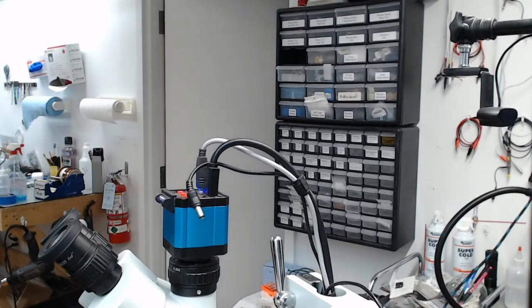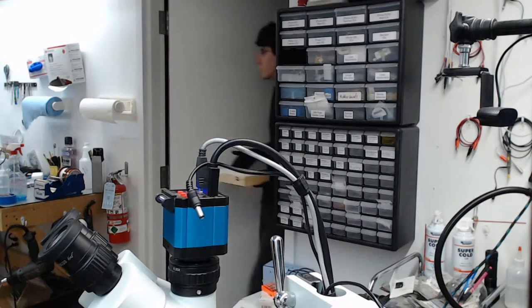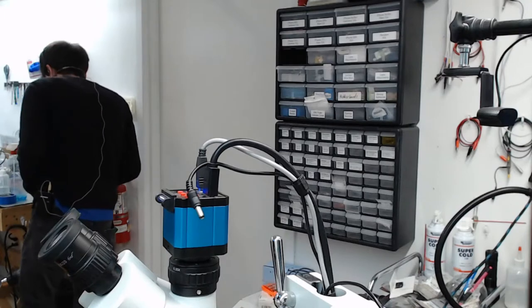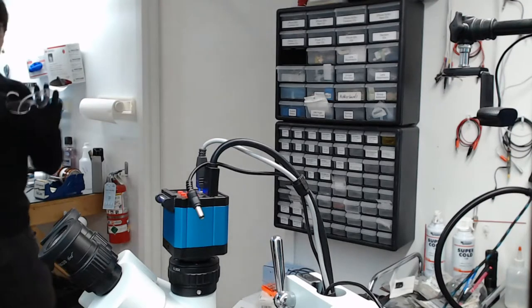I only recommend doing any type of cutting with a Dremel if you have a steady hand or experience with a Dremel, and you want to make sure you use a really, really thin bit. Like, I use a diamond bit, bought them in bulk, very, very handy, but it should be able to cut without going too deep. The cutoff wheels that are made out of sandpaper might be just a little bit too thick to cut through the screw. Also, since it is metal, you will want to use safety glasses.